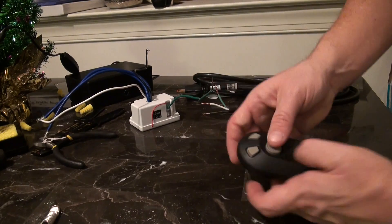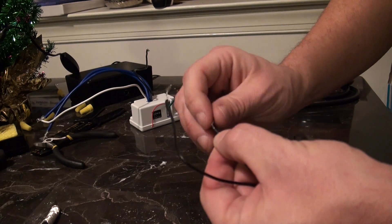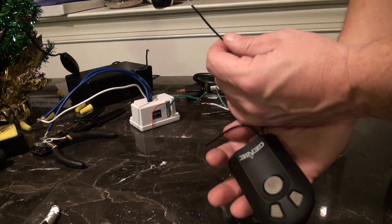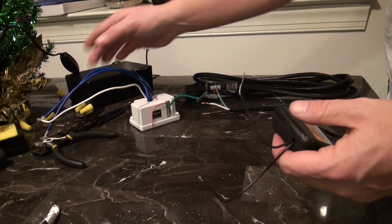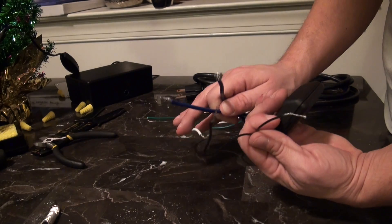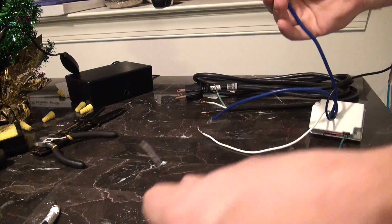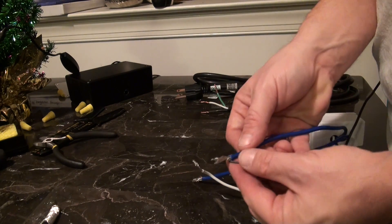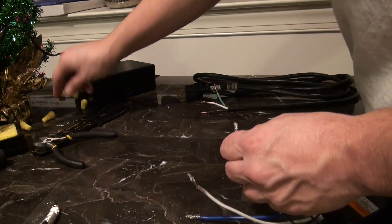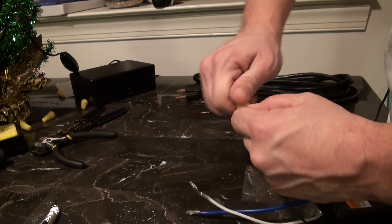There's proof the garage door opened. Alright, so the garage door remote is done. You're going to have two leads coming out of the bottom. Those leads are going to connect to the two blue leads on the Z-Wave relay, and that is going to control the garage door. So we're going to go ahead and connect the blue lead to the black wire. We're going to take a wire nut and wire nut the blue lead coming out of the relay.